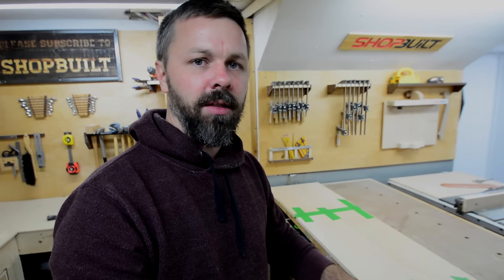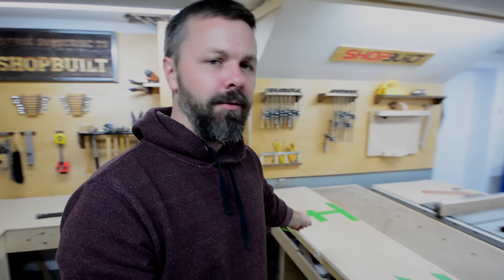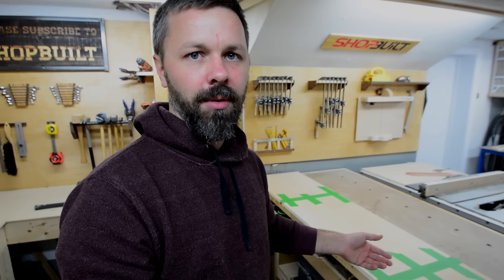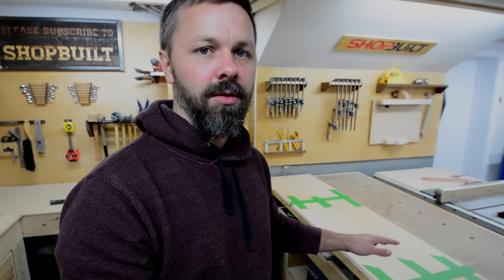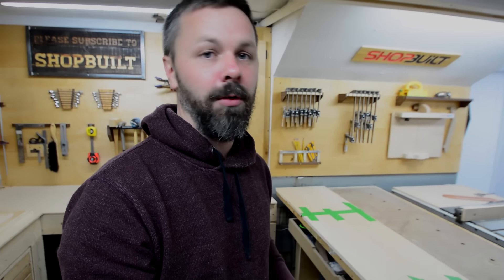I think I'm ready to give this first cabinet a try. What I did is tape the back of the miters like you normally would with something like a small jewelry box. I only got enough room to put three of the panels taped together, so I'm going to flip it over and glue it up. I do have the advantage of being able to use brad nails since it's a painted cabinet, so I'll do that to hold the whole thing in place until the glue dries.